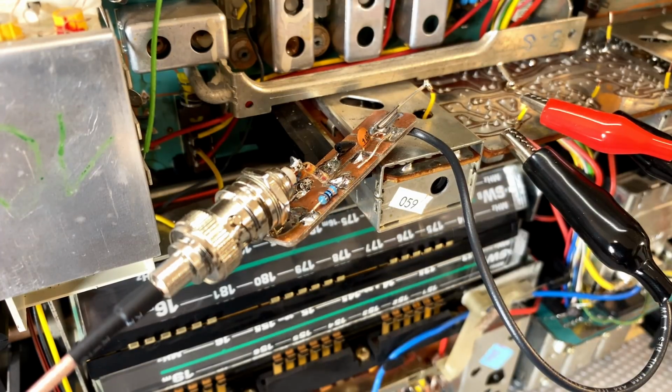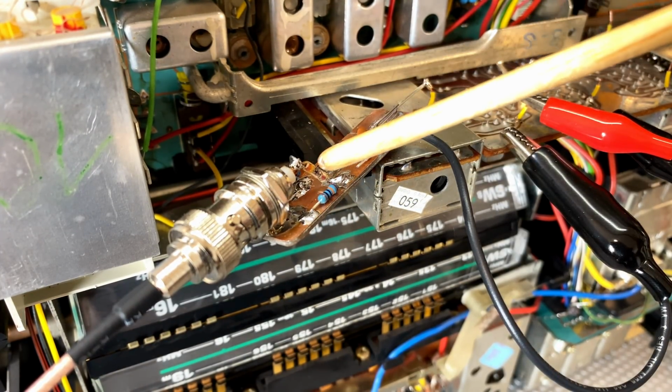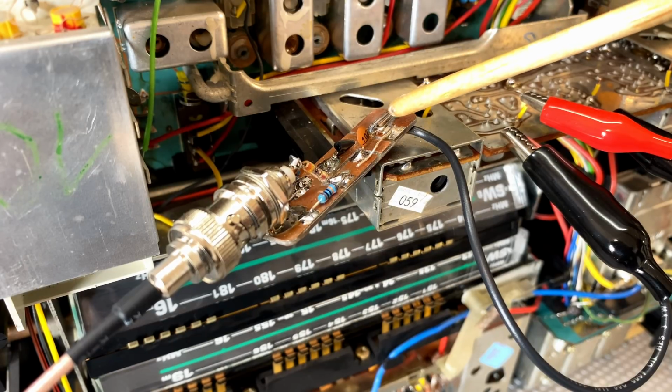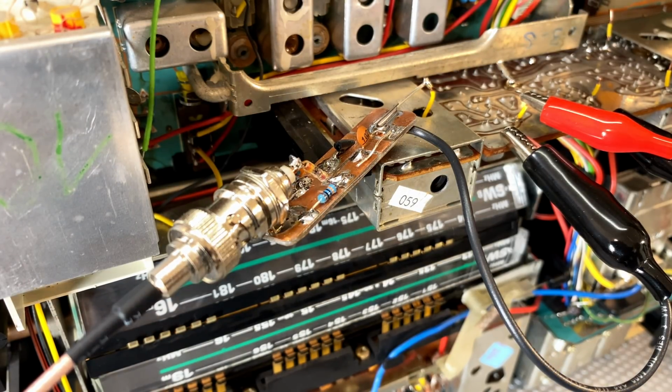solder that little wire in, and then I can connect the probe to it. And there's no magic here. Here's the probe built on a little bit of PCB. There's the diode. And just follow that circuit. I put a BNC connector on here. I've got a little rigid wire on here, and I've soldered that. This is the probe itself, the tip. Soldered that to that point, so we're now measuring that point all the time.